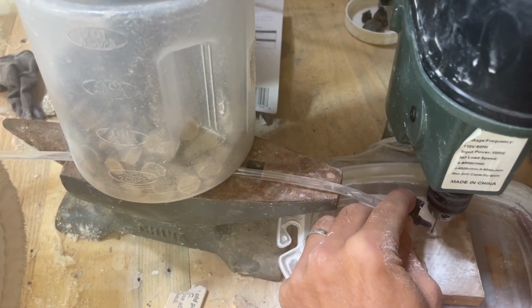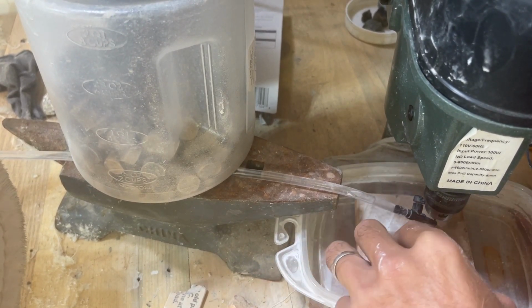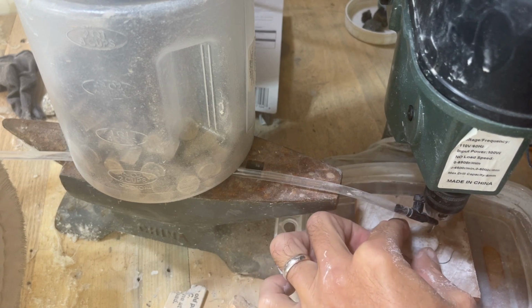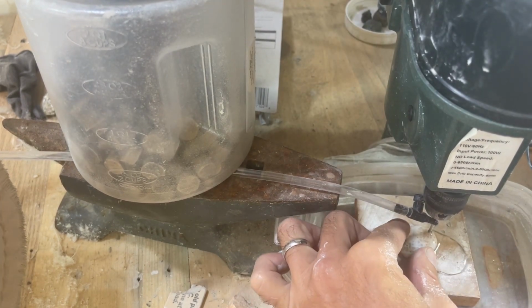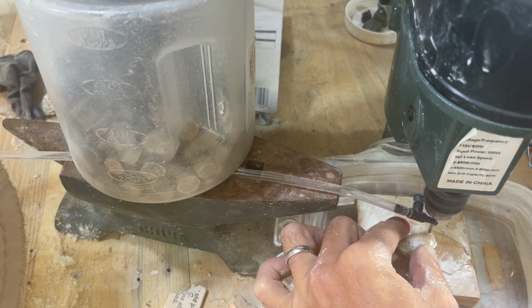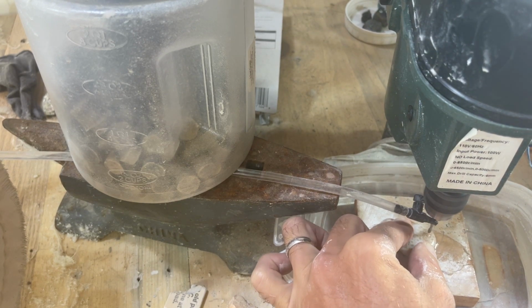I'm going to start first by drilling a smaller hole. I'm going to do a 2mm hole, and after I get that one started, then we will switch out to a 5mm. This clever contraption you're seeing here with my tube, it's since been upgraded, but that's actually going off to the left and going up. It's all being gravity fed from a 5-gallon bucket that I have.